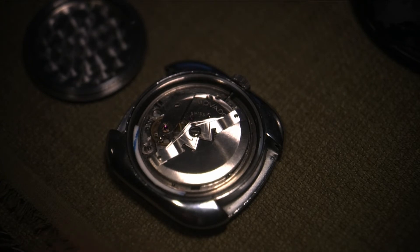Everything is really sensitive, and I'll tell you why — because there are two screws that hold the watch face to the watch itself. If you have it in the wrong setting, then the date wheel won't turn. You have to get it exactly right so there's a tiny gap between the watch face and the watch, and then the date wheel spins nicely.